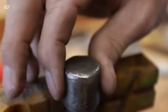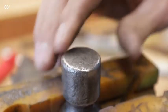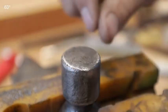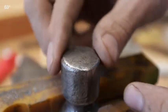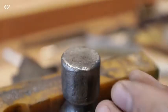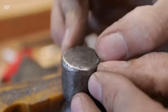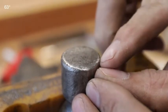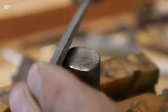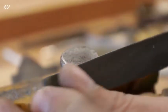Now on the strike face, this has to be done right — you have to be really careful. You have to remember not to grind them flat. The strike face needs to have a bit of a convex to it and a little chamfer around the outside. This is actually really good and, the more I look at it, I'm not going to fool with it. If you wanted to change that, the process is just the same — you file across and rotate around, then put a little bevel around there. That will prevent chipping: if you miss-strike and hit the corner, it's going to be a much stronger edge.